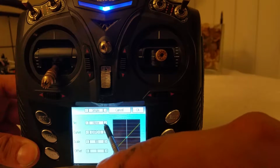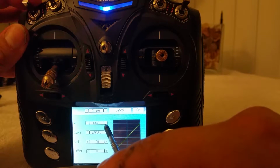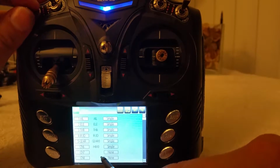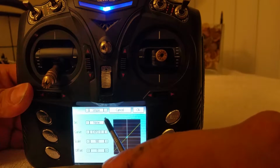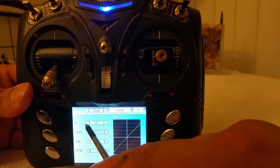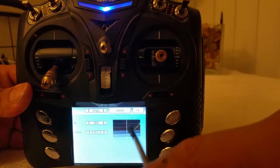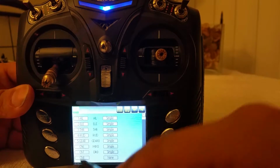Alright, so let's go ahead and quickly fill in the rest. Simple. And for channel 6, I want my mixer menu to be in charge of channel 6. There you go. My mix switch is now channel 6. For channel 7, simple, I want DR, dual rates, to be channel 7. So this is channel 7.